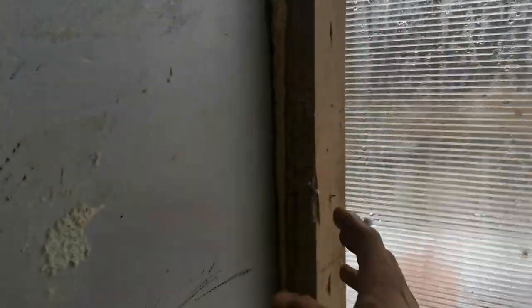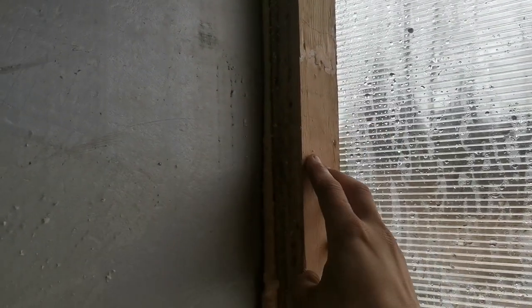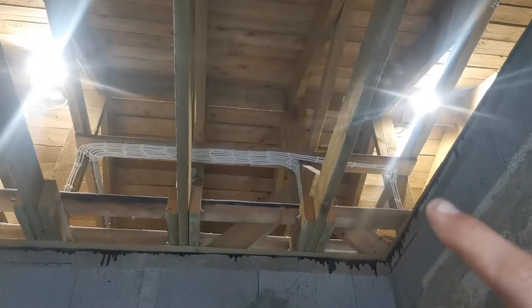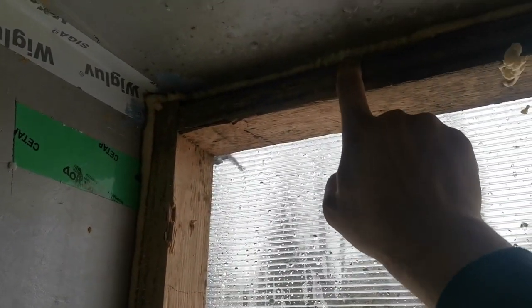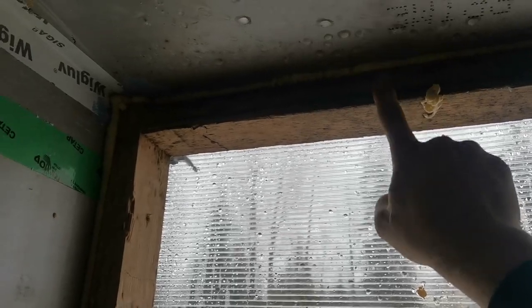That's why you can't put wood inside foam — because if you don't know what you're doing, it's really easy to get mold. This was just for the winter, so I already knew it would be molding, and it doesn't really matter because it's going to come out and the mold doesn't get into the house frame. This isn't treated timber — it's new timber. But this other piece is a little bit green; it's treated timber with anti-mold, anti-fire treatment. So be careful — foam and wood don't go well together.